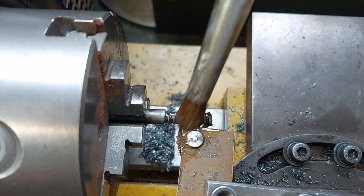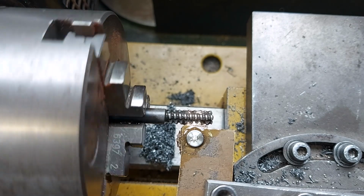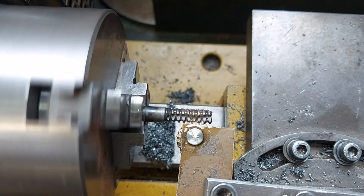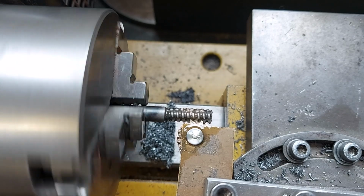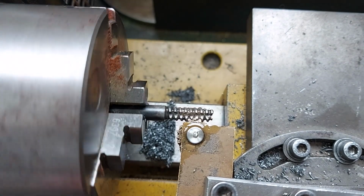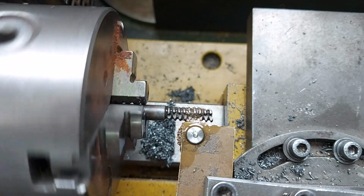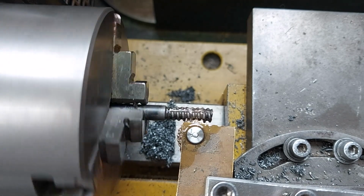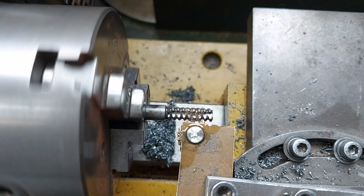So lots of cutting oil, and then I'm hand cranking the hob. So you can see I'm hand cranking the hob and the gear's going round. It's a very simple makeshift bearing, 2 pieces of brass reamed out to 6mm to take these steel, effectively a steel axle bolted each side of the brass gear. And then I just carefully, gradually wind the gear into the hobbing tool.